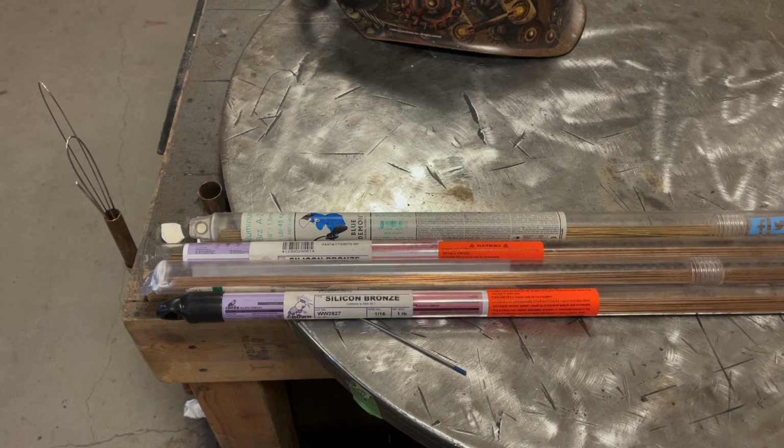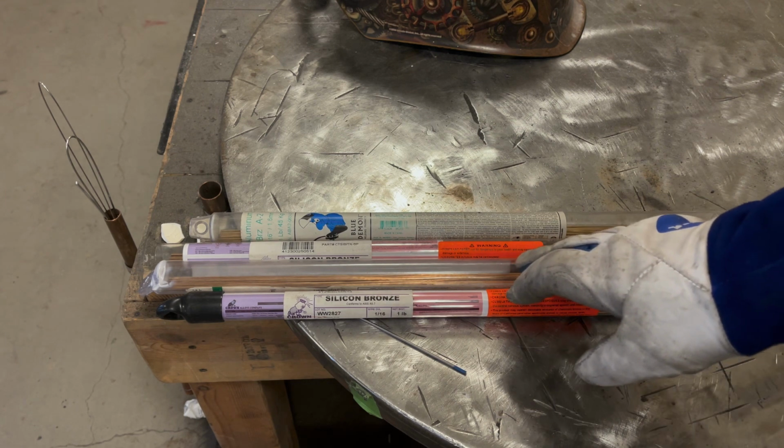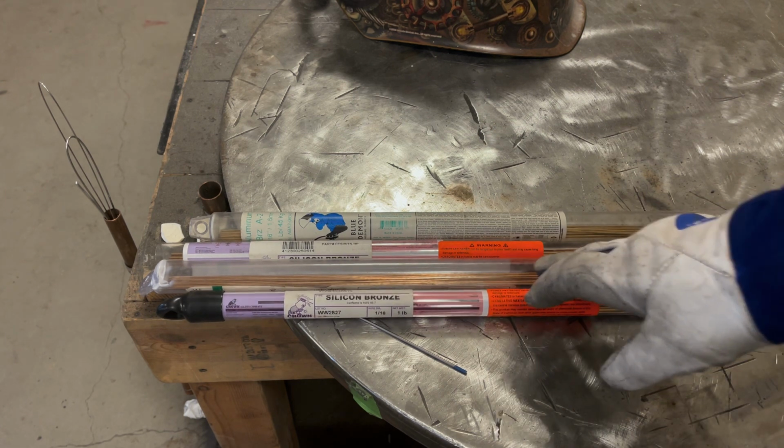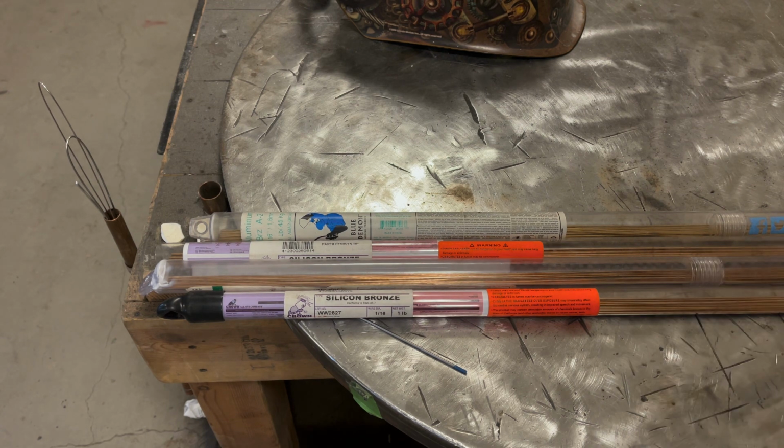Quick details on that. Essentially, with welding, you're melting the base material. So your filler melts and your base material melts, and you create an alloy known as a weld. With brazing, you're not melting your base metal, you're only melting the filler, and essentially it works like, I guess, glue of sorts. It's a lot stronger than glue, a lot stronger than JB Weld, and a lot stronger than soldering, which is similar to brazing. Much, much stronger than that.